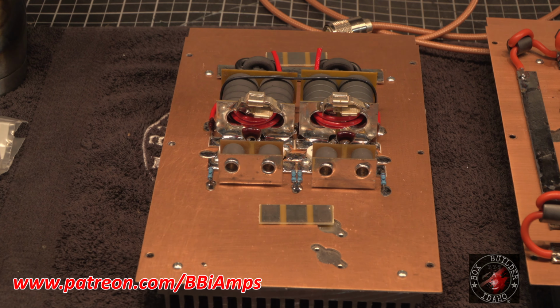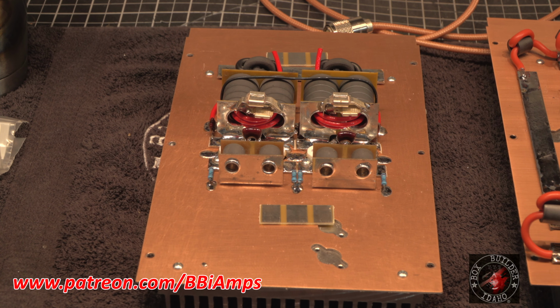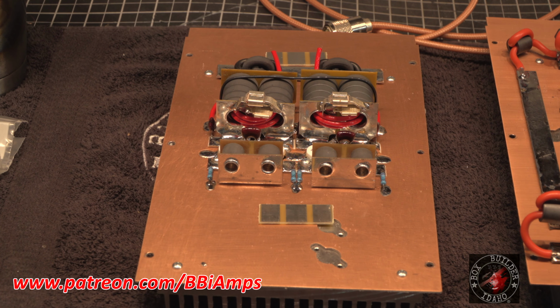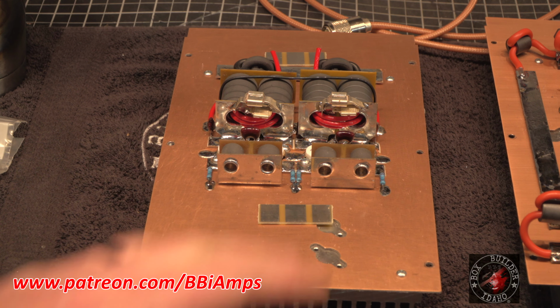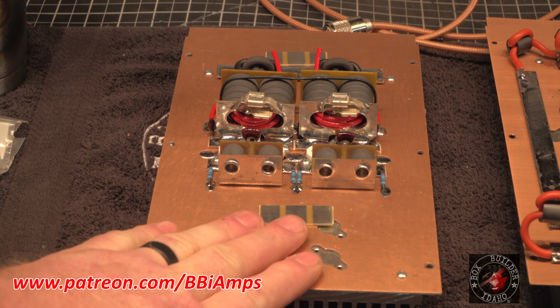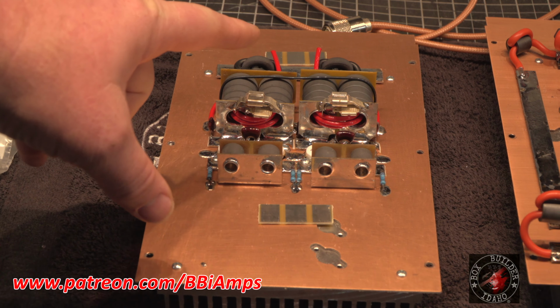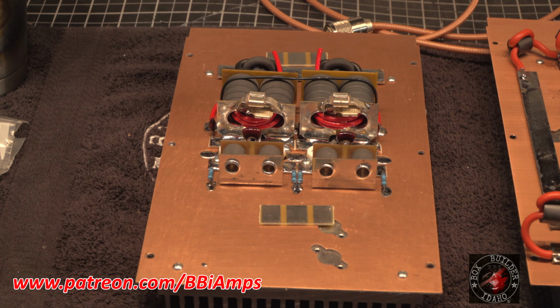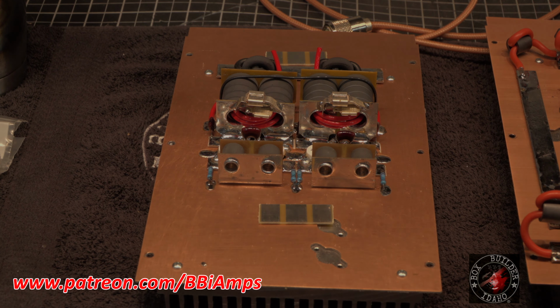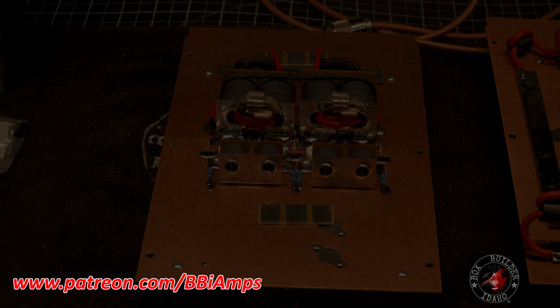And moving along, we got the input and the output networks done. We got our power wire done. We've got our high temp silicone wire that we're using on our power distribution bus. And next step is to do the input transformers, get them wound up. Get our input splitter network put in place, get our output combiner put together, get the relay down, and start drilling holes in it for the sideband, relay, on-off, delay, and remote. Yay. So anyhow, away we go.